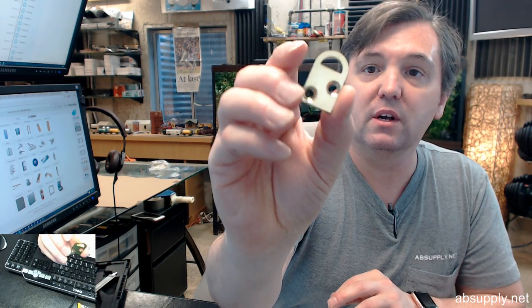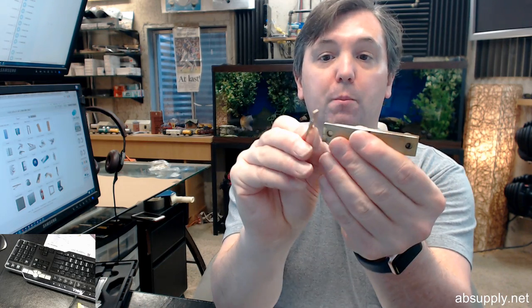If you've got a flush condition, like a pull side mount, or maybe you're using this as a Dutch door bolt, you'll use this rim strike. We'll consider that to be the same thickness as the mortise strike. It is 0.048. This could be used to great effect on a pull side mount, where you'll attach this to the frame, and then of course your bolt will go here and the door will swing towards you.